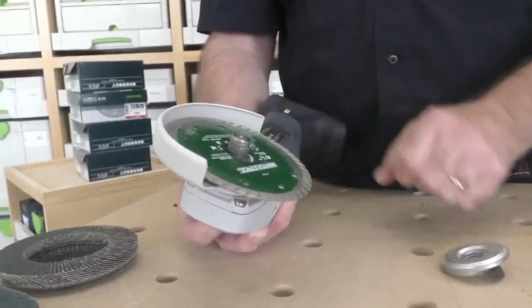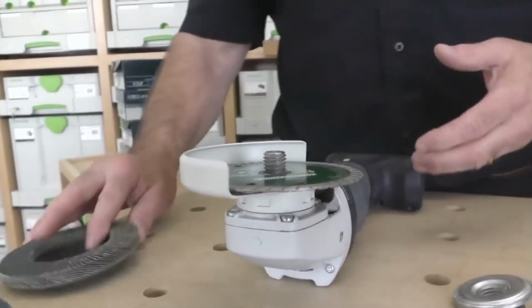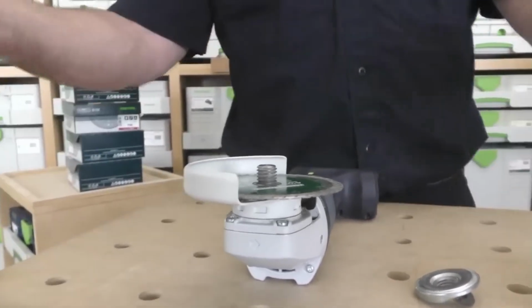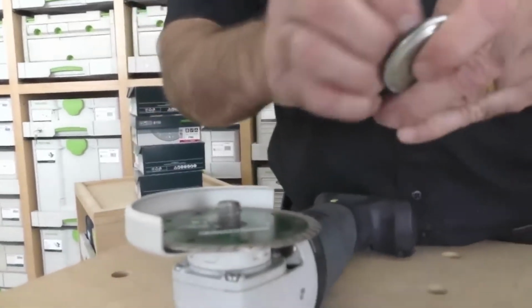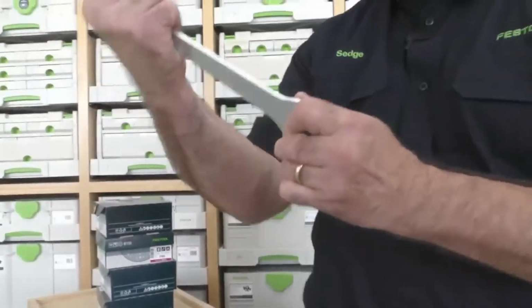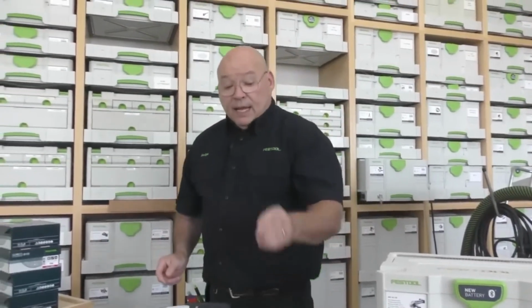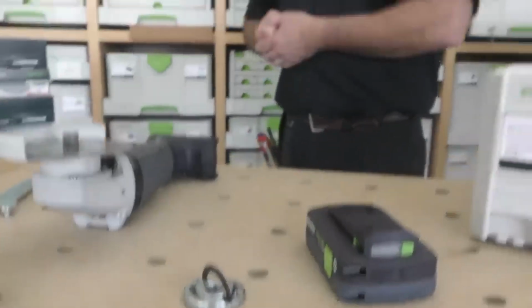And it's that quick. Now, if a lot of concrete dust or sawdust gets in there when I'm grinding or sanding with an abrasive wheel, or maybe polish gets in there and it's still too tough, I can't get enough torque on it, we have this. It comes in the AGC and it's your basic spanner wrench and you can get a lot more leverage with it. But this is available. It's the AGC Abernut. And what's really nice about this is a 5/8 11 thread. So listen to that one, everybody. You may not have an AGC, but this will fit your grinder. So there you go.